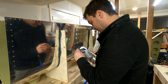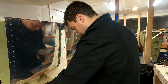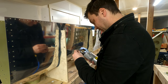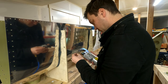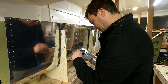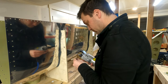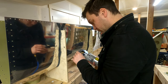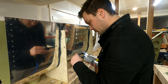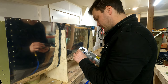If you're wondering why it looks like I'm trimming my fingernails with the pneumatic squeezer, I am not. I am actually dimpling nut plates, and I found out I hate dimpling nut plates so much that I made a video about it — but that was lost in the hard drive crash. Where I could, I counter-sunk the material the nut plates were attached to so I wouldn't have to dimple them. However, in certain spots that material is not thick enough, which forced me to dimple nut plates. It's tough and it's tight and they don't like it. So where possible, I will be avoiding doing this.